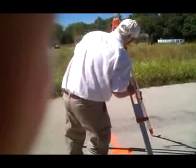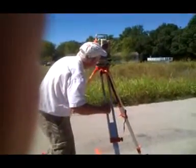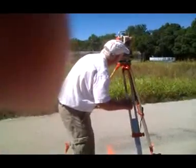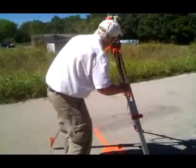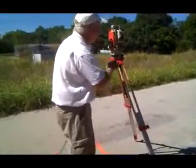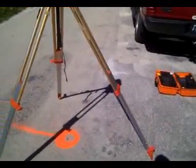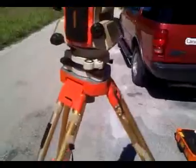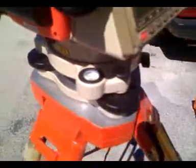I was right over it, now I'm having to find it again. Even though it's not level, you get the eyepiece right over it. Then shorten or lengthen each leg to get this bubble as close to level as possible. There's a bubble here and that bubble is what I'm trying to get as close to level as possible with the legs only.